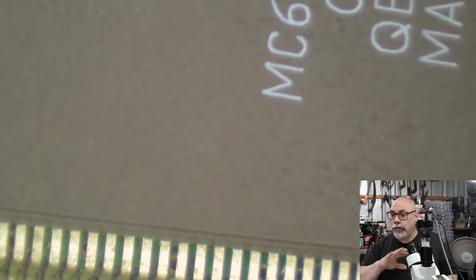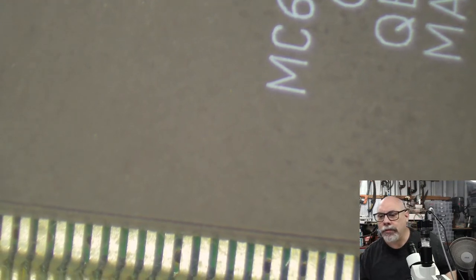Okay, my Color Classic doesn't power on at all when the logic board is installed. Once I remove the logic board, the machine powers on with just the fan running, which is normal. If you power on a Color Classic without the logic board installed, as long as the analog board is all working, the fan will run. It'll sort of run at full tilt. So I'm guessing the logic board requires a clean and a recap. Provided a link to a picture of the board below. Please let me know if you can help me fix this. Yes, yes, of course I can.